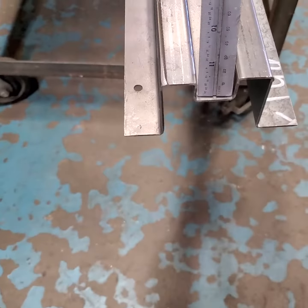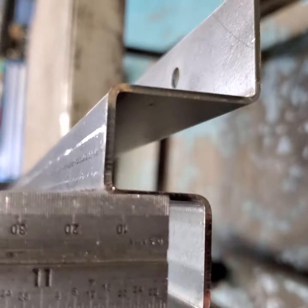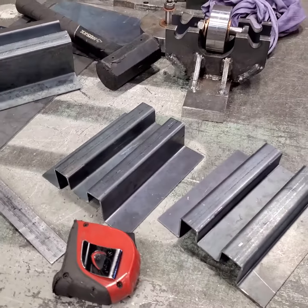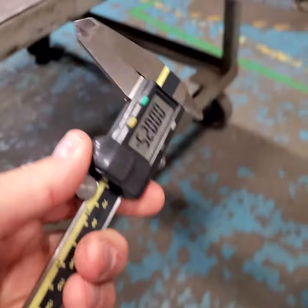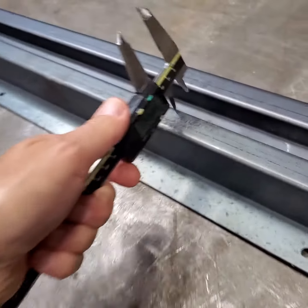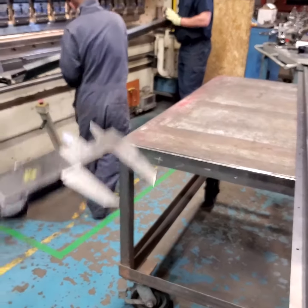If I take the ruler, the ruler goes through really nicely. The ruler is just a hair under one inch. Where's the digital calipers? Here's a .954. So it's under. Here in the center, 0.970. On the end, we're a little bigger — 1.06. I told him to continue with the next one. We'll see how it goes.